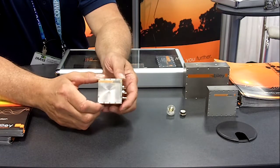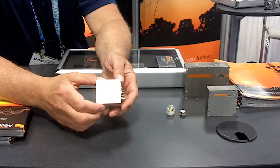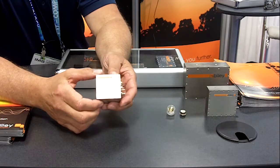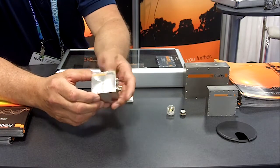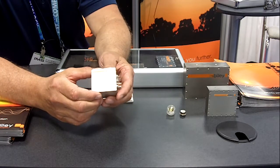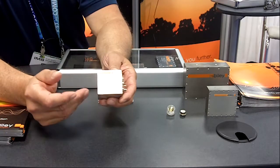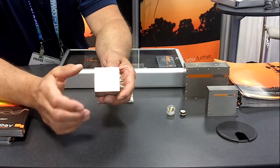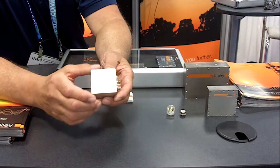To compensate for this uncompensated bandwidth, we have developed electronic techniques using sensors mounted in three axes of performance. We can sense what's going on inside the oscillator and assume the crystal is seeing the same thing, then interject signals to the crystal which will offset the change in frequency resulting from low-frequency vibrations.